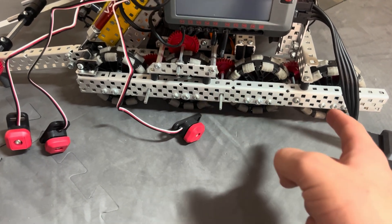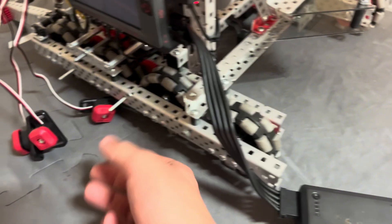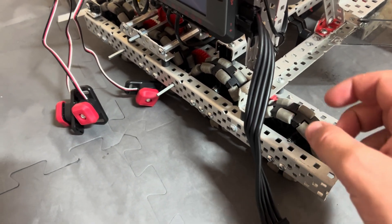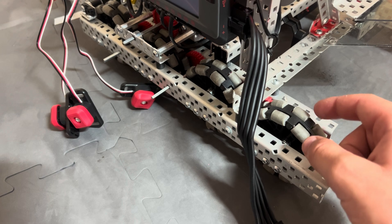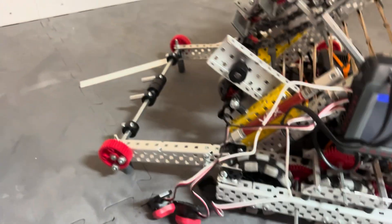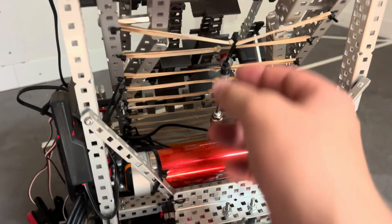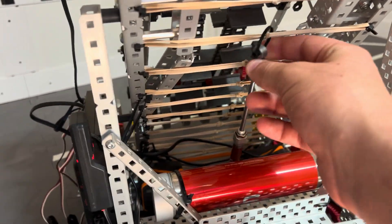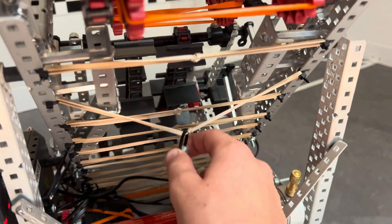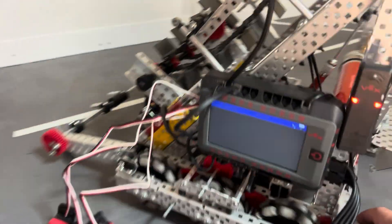On our drivetrain, there's no IQ gears this time, so hallelujah. Eight wheel, 3.25 inch, 450 RPM I want to say — I'm not great with RPMs. Pneumatics up here for the loader mech, and pneumatics back here for the mid goal. If it shoots up, the blocks go into the high goal; if it shoots down, it opens up this spot where the blocks go out and into the mid goal. Very, very awesome.